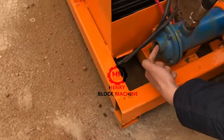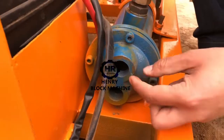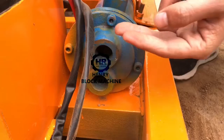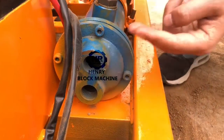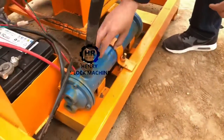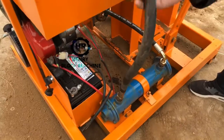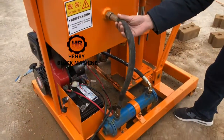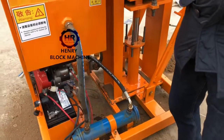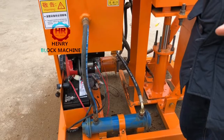Normally you will use a water pipe connected here — this opening is the entrance — so the water will recycle inside this blue unit, and it will cool the hydraulic oil, keeping it cool so the hydraulic system can be high efficiency.